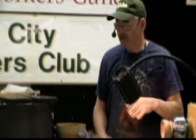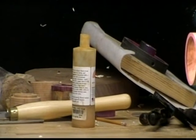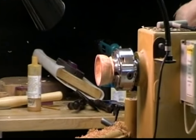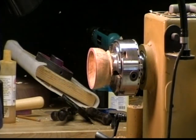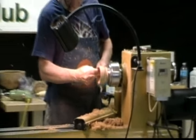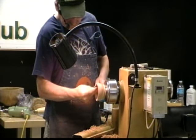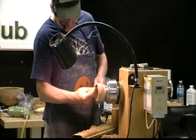Now, usually what you can do is you can sand down the inside of the piece a little. Okay, do we have scissors in the house? Or a knife? Just cut that about there. And don't go too far away. No, I mean, stay close. Now this is 100 grit Abranet. So we'll start with that. And this will take out any of the rough, torn grain areas, or most of them anyway.